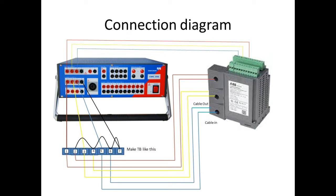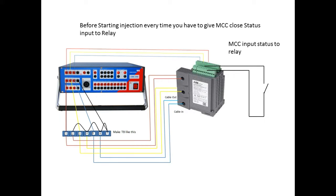For voltage input, connect to the top of the relay. The relay needs the MCB run status as a binary input. Once the relay gets the input, it should also receive current. If not, it will trip by feedback timeout. The default feedback timeout is 0.5 seconds, which is very short for giving MCB run status and injecting current. We can increase the feedback time up to 25 seconds. I am going to set it to 10 seconds for testing.